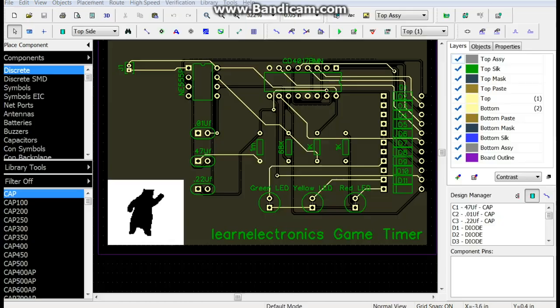So what that means is when we go to the PCB file, there's our 1K current limiting resistor, okay? See how when I do that, it shows where it's connected, and if I come over here we get that, boom, see how that works? Everything's connected somewhere, except for him. Oops. That should be connected to ground, so perhaps we can put a mod wire on here and make sure it works. What do you guys think?